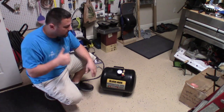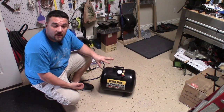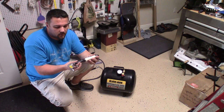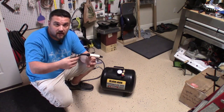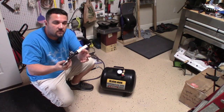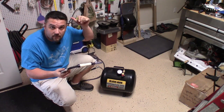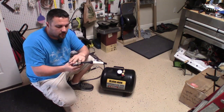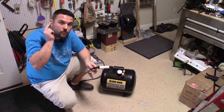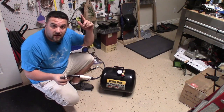Option two is going to be using compressed air. I've got my big air tank and I'm going to fill up this little portable seven gallon tank with about 100 psi of air. I'm going to take it upstairs using the adapter we used outside. I taped a little rubber hose connected to my air gun, so when I pull the trigger it'll shoot air down through the adapter. This should make a nice seal upstairs to actually blast air through the drain line and outside — basically reversing it. Instead of sucking from the outside, we're pushing from the inside.